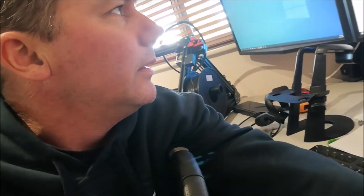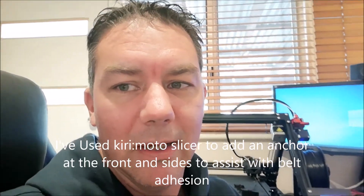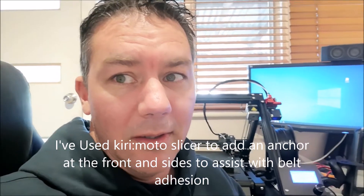Can anyone help me? Does anyone know what the original Z-step number is? The original number I had was 1148.4, and the piece printed from that step was 98.35mm. The second piece was 96.63mm — so it got worse — and the piece after that didn't even print; it failed miserably. Short of putting a random Z-step value in, I don't really know where to go from here. I'll put a little video of what happens with the print — it definitely pushes forward. Hopefully someone can help me.